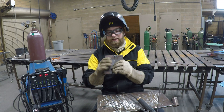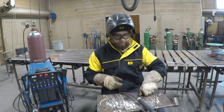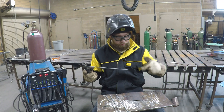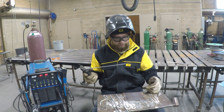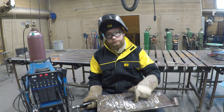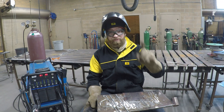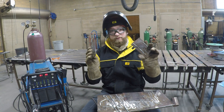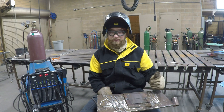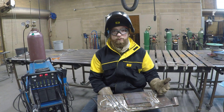Now we've got our plates tacked together and they're pretty level to each other. We're going to try and shove this electrode through that gap, pushing the weld puddle and the arc all the way to the bottom of that joint. If the metal is sitting directly on the table, there's a possibility we could weld this coupon to the table — and if you do that, you'll spend the rest of the period trying to grind it off. So to prevent that, we'll get a couple of pieces of scrap metal and prop up the workpiece. This also means a lot of spatter on the table, which is why grinding the table every day matters.